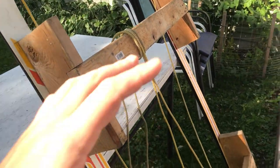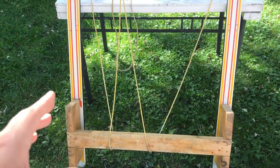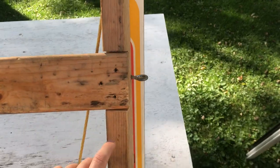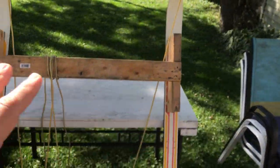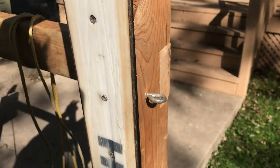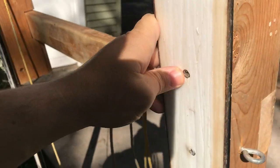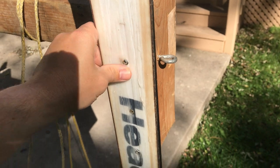I'm going to run through this process as fast as I can — this is a really simple thing almost anybody should be able to do. Cut your blocks so you have plenty of room; I think I did four inches on either side centered around the two by four. Countersink your holes before putting screws in — use a drill bit, about a quarter inch deep — so the screws are set underneath the surface and don't stick out. Cover the screws with wax every season.